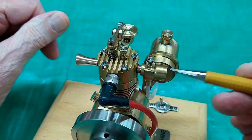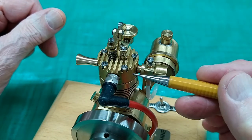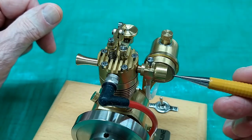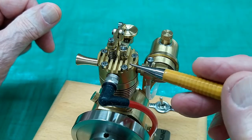The atmospheric intake valve — when the piston is on the intake stroke, it's traveling downward and draws a slight vacuum on top of the piston. Atmospheric pressure opens this valve, allowing air to go in through the carburetor and mix with fuel for combustion.